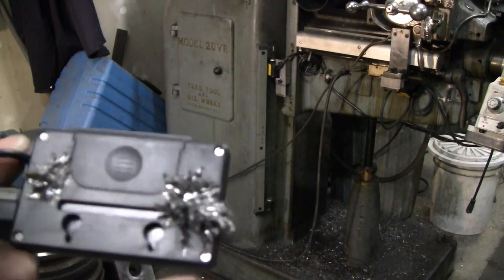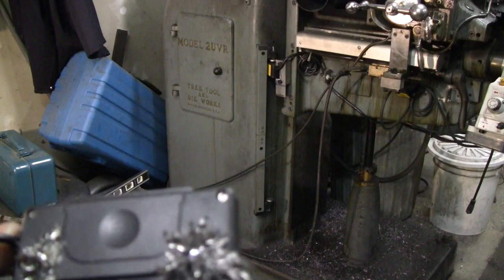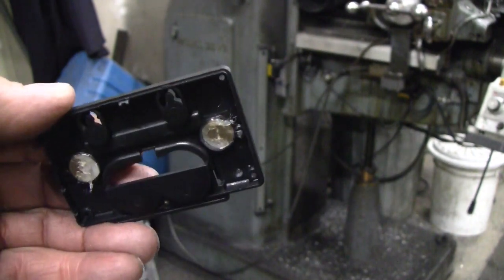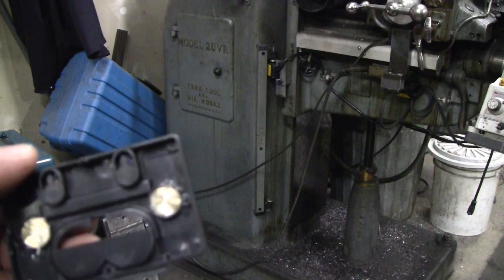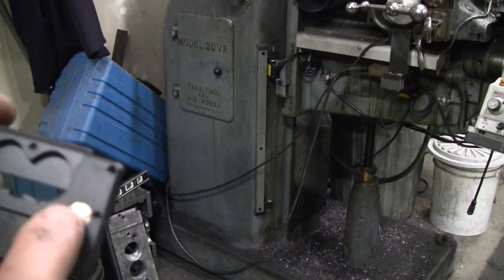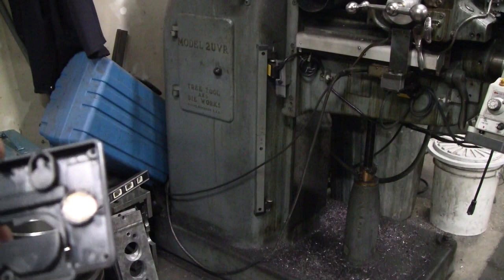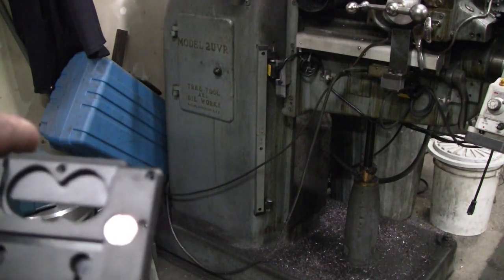Probably going to have to take it apart. There's four screws in the corners of the case, and I push those out from the back side, or from the inside of the back lid. Regardless, those magnets are going away. The magnets are 12 millimeter in diameter by about a millimeter and a half thick, just under half inch by a 16th. They're secured with hot melt glue and have to go out toward the inside of the lid. This hole is smaller than the pocket, so I punched them out, turned up a couple of bits of brass rod, and glued them back in with hot melt glue, same as the magnets were glued. So now I can put this back together and it won't attract chips.